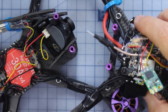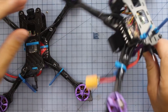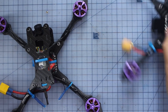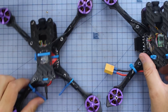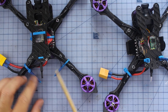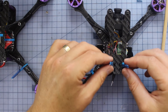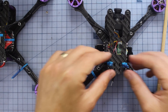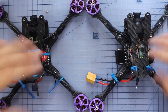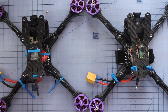With receivers in both builds, we put the drone back together. I want to show how I mounted the receivers - you don't want them hanging out where props can cut them. Option one: put your receiver down with double-sided tape. Option two: a zip tie going all the way around. For the antennas, you want them out of the props and nice and straight. On the 4S version I've run them out the back of the arms at a 45-degree angle; on the 5S version I've put them at the top. They're held on zip ties with heat shrink - our drone is 100% built.